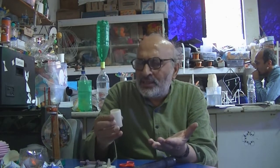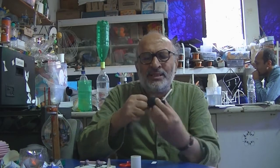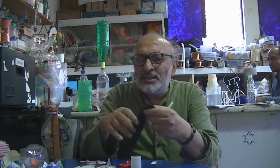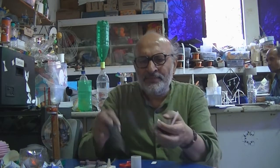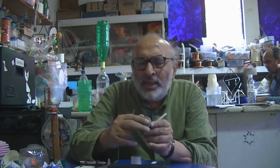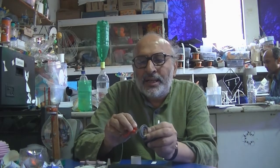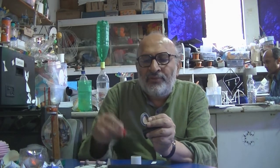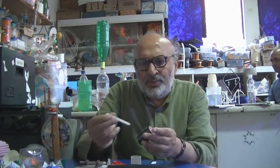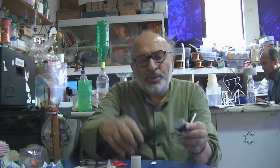This is my suction valve, and this black tube, about 7 or 8 inches long, is like the bellows, which I'm going to move like this. Just a through tube, there's nothing inside this. This is another film can with a lid, and I made a hole in the lid. Similarly, I have made another valve which can open and close. This is my delivery valve, and for the air to come out, there is a stiff straw and a tube. That's it. So children can dismantle the whole toy and put it back again.